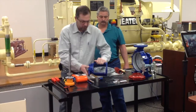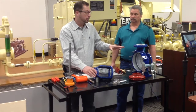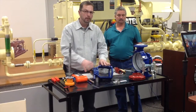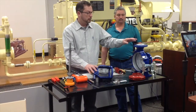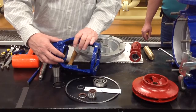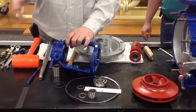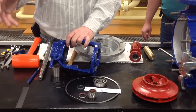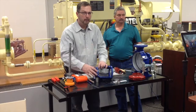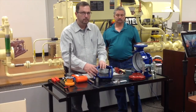Another thing that's important to remember is this pump is made to serve in several different applications. It's for industrial use. They change a few things about the pump, and they can operate it up to 600 degrees Fahrenheit. And the way they do that is they put a mechanical seal in here, and they pipe a couple of cooling lines over to a little small radiator and fan, and they have that pump constantly run coolant through the bearing housing here in the mechanical seal application. That's what this is for.